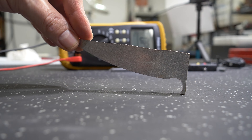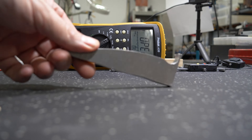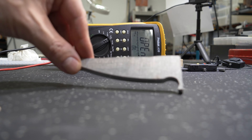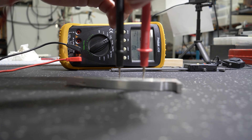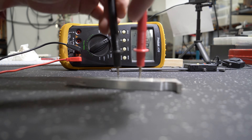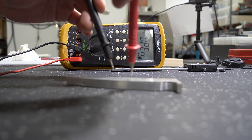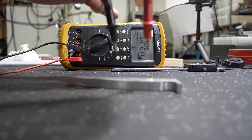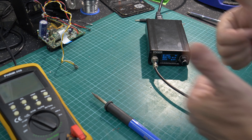Just as a side note, in case you're wondering - this is a piece of aluminium offcut from a 3.8 or 10 millimetre plate. This is untreated, no anodizing, no clear anodizing, nothing. You can always tell because you've got continuity from the get-go, whereas with the soldering iron case you have to really scratch into it to get any continuity. Raw aluminium in itself conducts electricity very easily. Just so you know - thanks for watching.